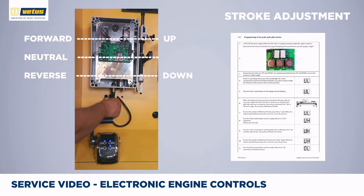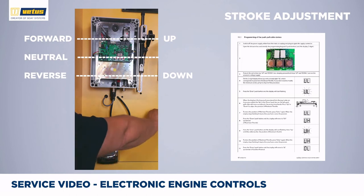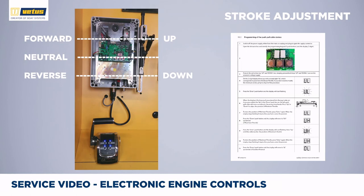To increase the stroke, remove power from the system — for instance by removing the power connector — then press the up and down button and reapply power. You are now in programming mode. With the enter button I can change whether to set the forward, neutral, or reverse position, and the manual will tell you which code means which stroke. Jog the lever all the way down to make sure reverse is correct, push enter to set the neutral setting, and then change the forward position. Press enter to confirm. Cycle power on or off, then check if the length of the stroke has actually changed — you can see the stroke is now much longer.